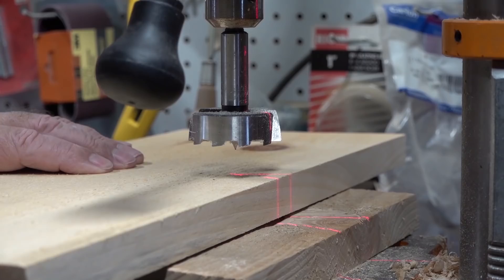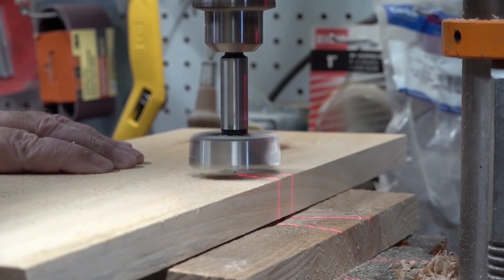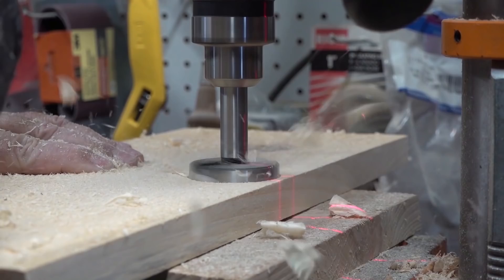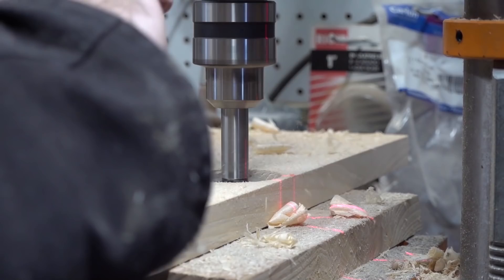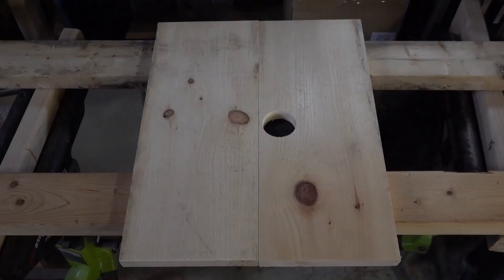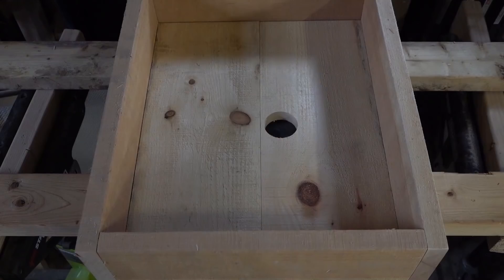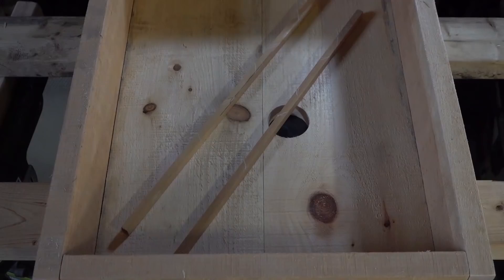With a 10-frame there's lots of extra space so this will be off-center a little bit. I'm using a two-inch Forstner bit — look at these nice clean ribbons flipping off the camera, nice sharp bit. We'll cut through that, and this is done before we glue up the pieces to compose that inner cover. So when we put this shim together we're going to clamp and glue it up. You don't get a lot of play time here — this video actually took me a long time to make even though we're doing this in 14 or 15 minutes. Now the inside edges are nice and square.